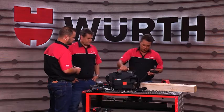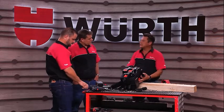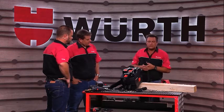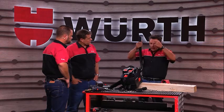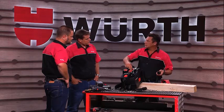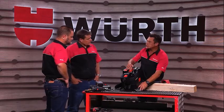I want to show you guys something. When you're in a spot, sitting in someone's house, and you can't go and clean your filtering system, which I will explain in a couple of seconds, you can have a quick clean. So what is a quick clean? The filter gets clogged up, and you would like to release some of that extra dust that's sitting on there. While your machine is on, you tap the button. What it does is make a vacuum, leave a vacuum, make a vacuum, and it drops all the sawdust. Nice. So you've got that instant that you can carry on again.